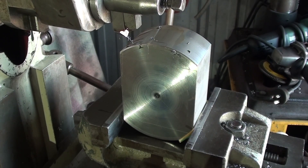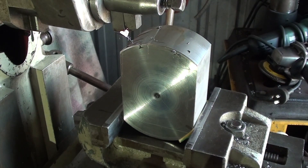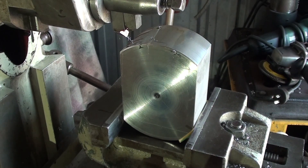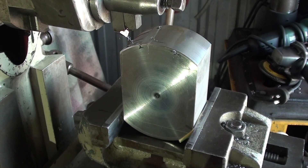This is where I'm up to. I've flipped it and touched off up top. I'm not going to be taking overly heavy cuts on the top — there's a fair bit of stick-out of the vice. I don't really trust this vice that much; it is well used. The old fellow before me did use this vice on the drill press quite a bit from what I can gather. So I'm just going to take it a little easy and take a little while to cut this down.